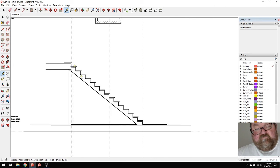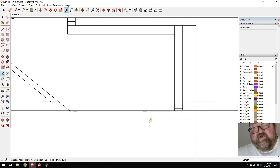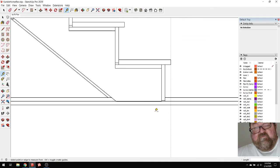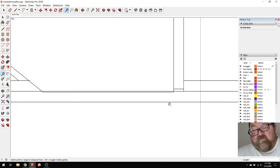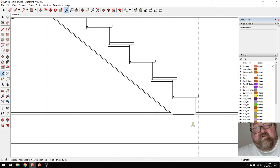Now, what you'll do is you'll remember that, because you went through this whole process of drawing this out. Now what you can do is measure from this line down to that line, not the bottom one. That's the one you're going to take off. That needs to be 6 11/16, your bottom piece. But you take that off the bottom. Don't start cutting it out of here. When you start adjusting your stringer, make sure you cut it off the bottom. Don't cut it off this right here. Right, so I'm going to leave that like that just to remind me.